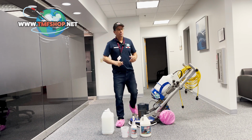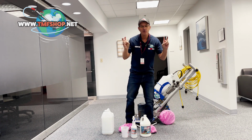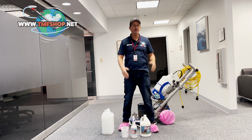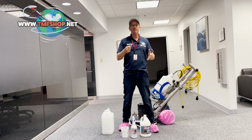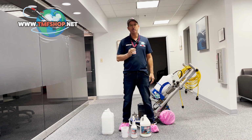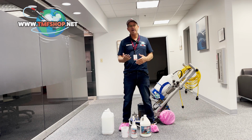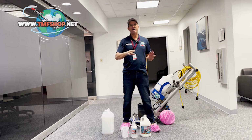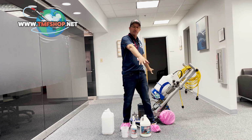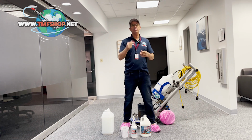This office, when TruckMountForums is mostly known for hot water extraction, which is HWE, or truck mounted cleaning, because we are TruckMountForums, right? However, there are certain situations where VLM really does a good job. And this is a great one right here because this is a high security location. It's 6 floors, and there's no access to really get in and out with a truck mount. On top of it, it's not very soiled. It's not very soiled at all, and notice it's CGD. That's commercial glue down on concrete.